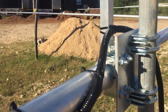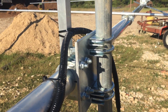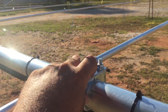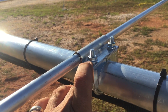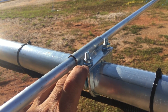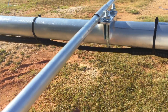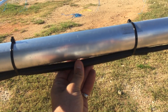The other thing is the instructions were not very clear to me. If you're not used to building a lot of antennas it might be a little harder — just kind of fake it till you make it. I also didn't like that none of the U-bolts had lock washers with them. They have little serrated cuts on the nut, but they didn't come with any lock washers, so I went ahead and bought lock washers for all of that.